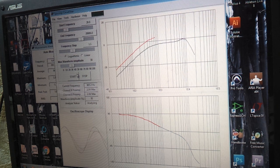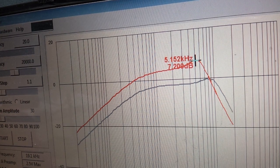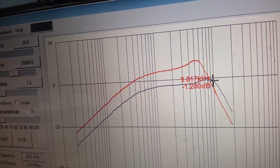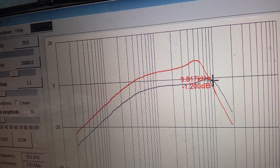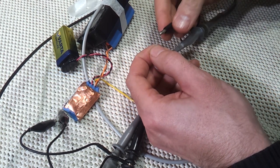The scope's input impedance is 1 meg, and for my bass, where the pickup directly feeds the preamp, like most Stingrays, that treble peak will certainly be audible. But if you have a passive bass, or if you have a volume pot between the pickup and the preamp, then those peaks, of course, are far more gentle. Your bass may actually start to roll treble off quite a bit below its pickup's resonant frequency.